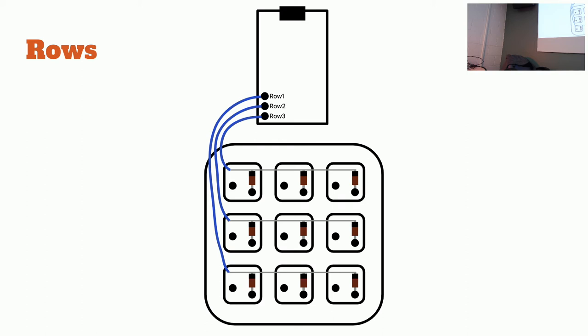First of all, I guess I'm pretty sure it's right. But should I wrap these around? Like how far in? I wouldn't suggest wrapping them really. Do insert them through. But once you solder it from the top, add a little bit of solder up here, and then down here you'll just want to cut them flush so that it can lay flat right here. Good progress. Shoot. I still have room. Yeah, you still got enough wire there. It's fine.